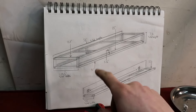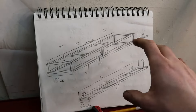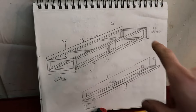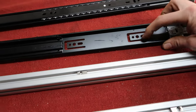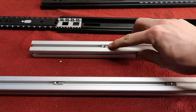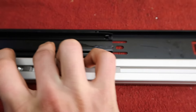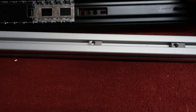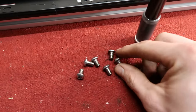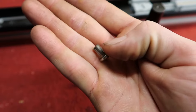We assembled the two outer rectangles and the two bottom bars. You'll find you're going to have to assemble and disassemble certain things as you go, because this is quite literally a puzzle. Next we work on the bars that the drawer slides are going to mount to — those are our 25-inch pieces of one-by-one extrusion. As you can see, these drawer slides have three mounting spots. You take your t-slot nuts, which drop in rather than sliding in from the side, arrange them to line up with the holes in the drawer slides, set the slide on top of the extrusion, and put the screws through. These screws are slightly shorter so they don't bottom out on the extrusion and fail to tighten down on the slides.